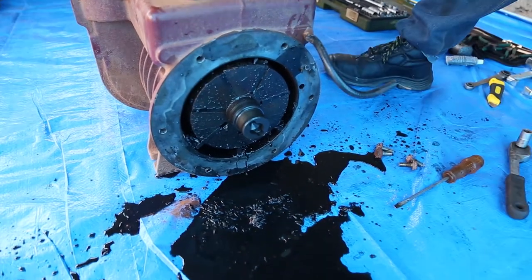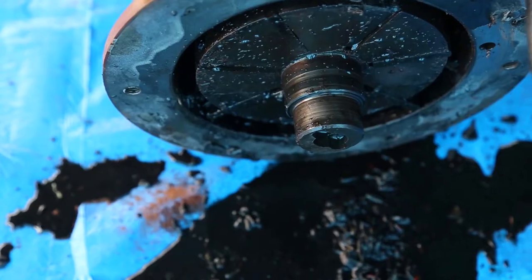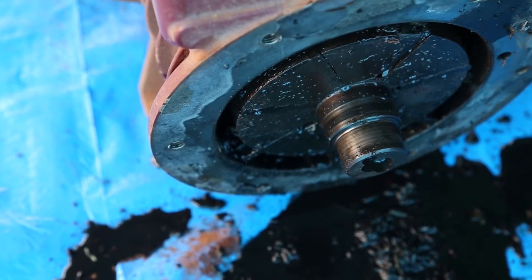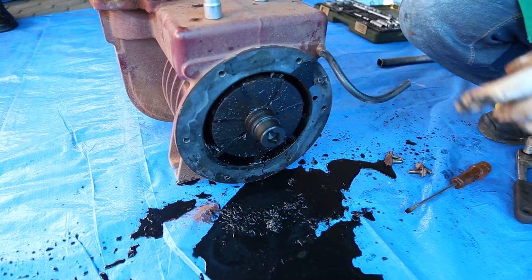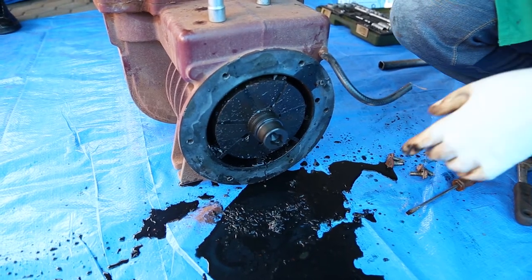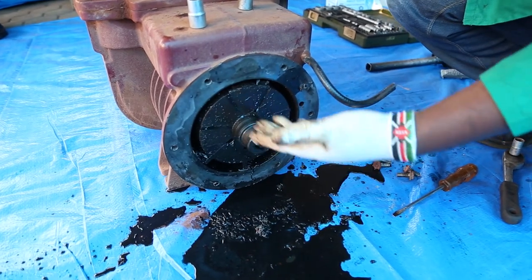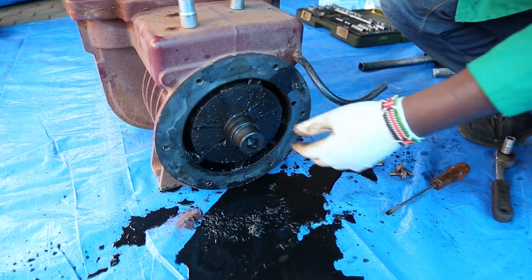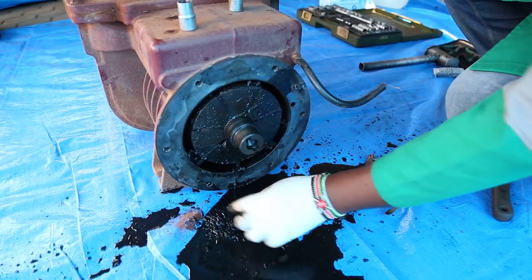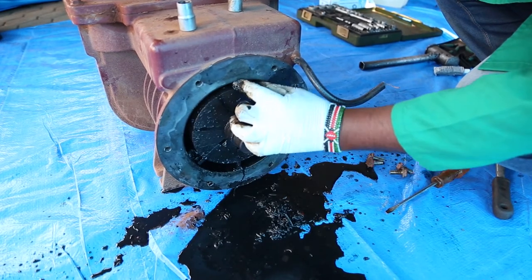So the truck is usually installed with two. We are going to do another video about all the things which are supposed to prevent sludge from getting inside the chamber. So there's a primary and secondary shutoff valve which usually prevents sludge from getting inside here, because when it gets inside here, it usually jams the rotor, and you can see all these sludge inside the rotor, and then the blades are going to jam.